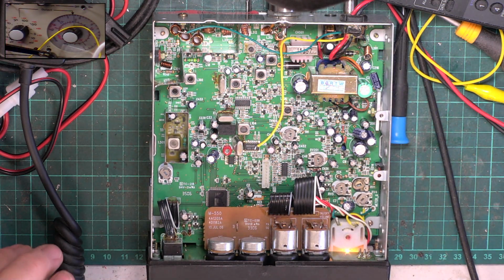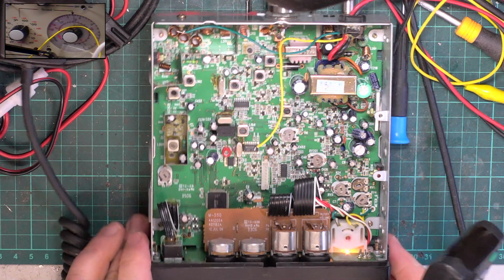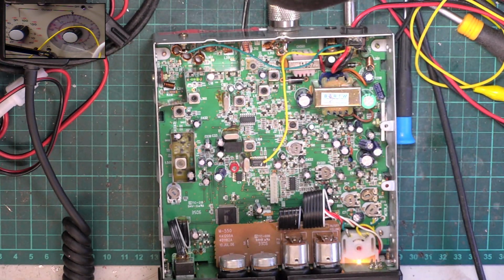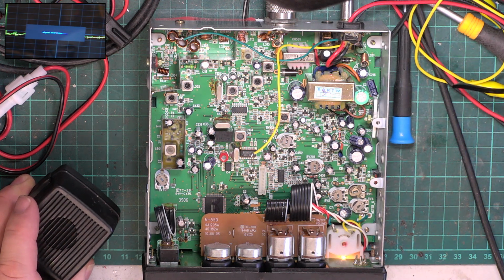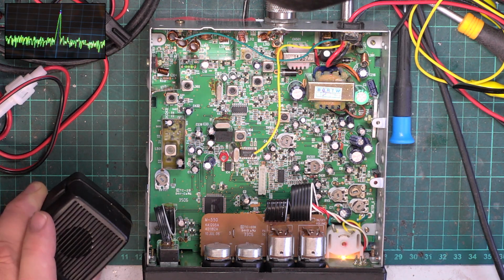So we'll get the spectrum analyzer on and I'll just see whether it's clean enough to be acceptable. I'll make sure we're on UK channels as well, and go to channel 20. So we've done the AM, we've done the FM. Just retracing our steps with the power, sorted it out, and let's go over to that. So I'll key up and press auto and let's hope it captures it. No, not good. It's picked up on 303 megs.